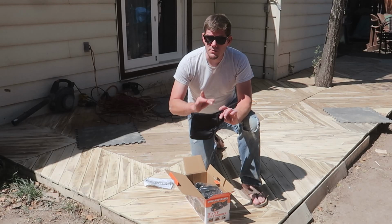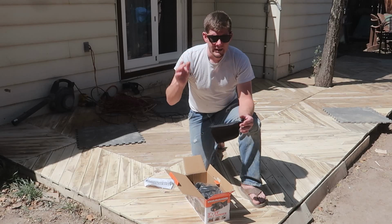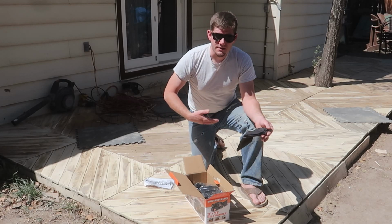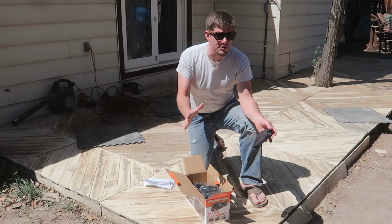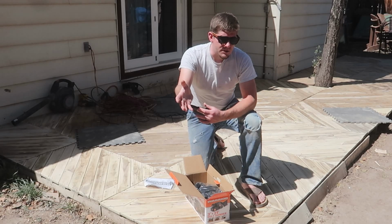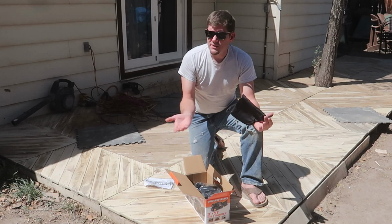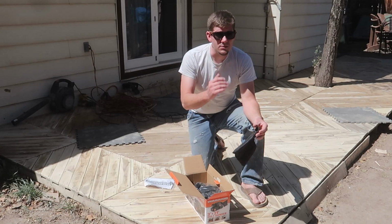It's actually one of the features I was really happy about because my Craftsman, which I've been using for quite a while, it's an oldie, is nice. It has a good belt cover on it, but no way for any of the sawdust to really exhaust except for behind the belt. So when I'm working on a flat surface like this and not near the edge of a table or whatever project I'm working on, the sawdust ends up kind of pooling, and if I pull backward instead of just going straight forward with it, I just kind of re-scoop all that sawdust and put it between the belt and what I'm working on. So it changes the grip pattern, and it can cause kind of an unevenness to it, so you only really can go forward with it.